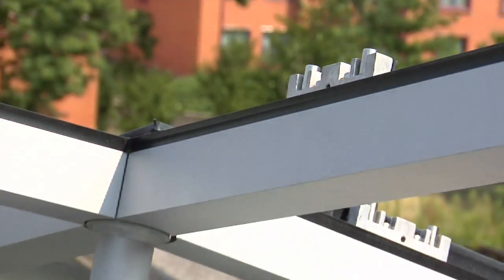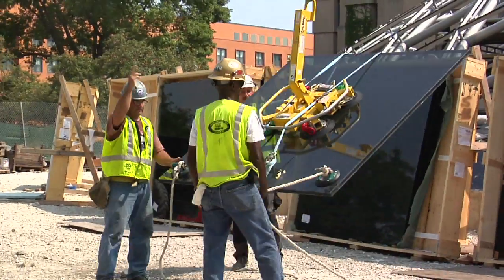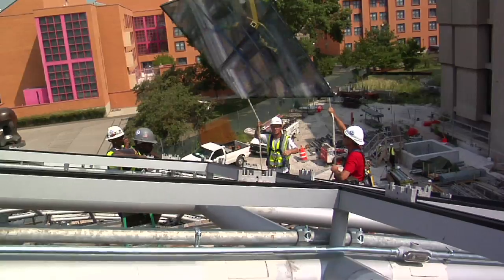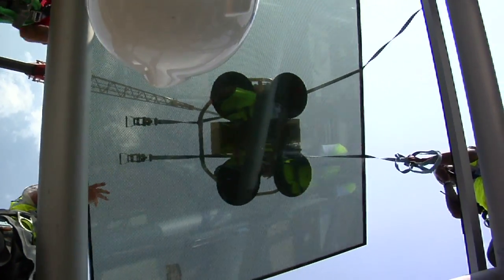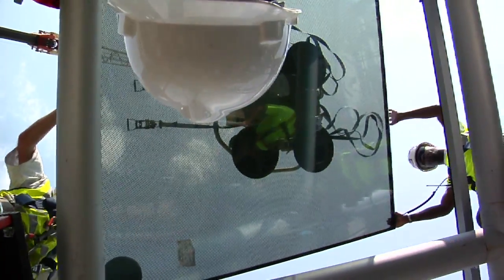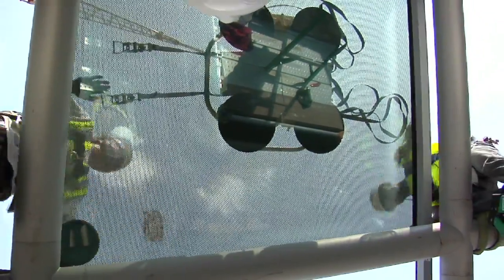The glass got manufactured in Germany and shipped over to the States. We have 700 unique glass panels, so every glass panel has its place — we can't swap them around; they're all shaped in a different pattern. We attach the glass to a vacuum sucker, and the crane then lifts the glass in place. Our workers know each panel goes in what spot, and they guide the crane into that direction. We have a crew sitting on the glass, specially trained with an abseiling system to work on the glass surface safely. They guide the panel into place, land it on the gaskets attached to the alloy and steel structure, align it, secure it with point fixtures, then release the vacuum cups and send the crane away to pick the next glass panel.